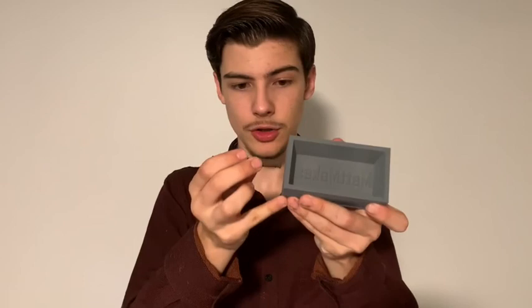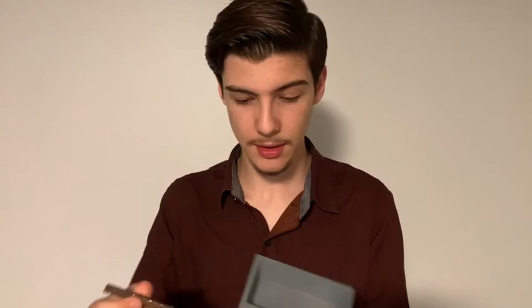This actually came from a longer piece of rebar in a previous video, where I was making the solid lead baseball bat. Still working on collecting more lead for that, actually. So this is the cutoff from that. It's going to be in the sand, just slightly overlapped or touching right here, so that when I pour cast iron into the sand, this will be fused to it and we'll have a little handle.